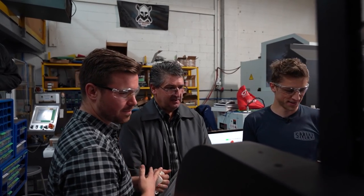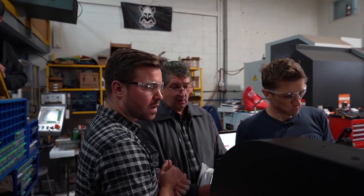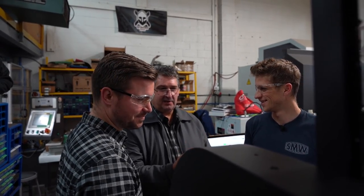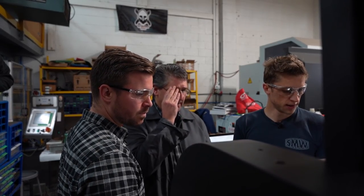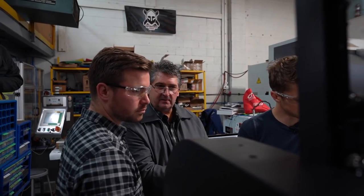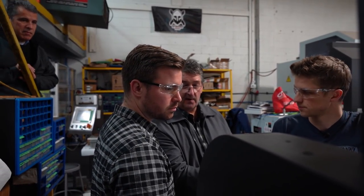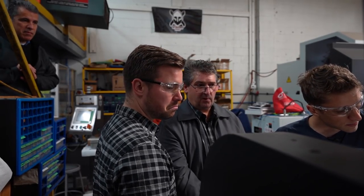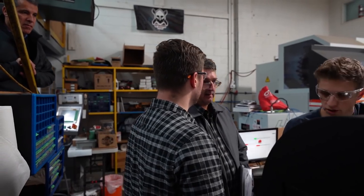Well, our applications team are pretty good. So they'll work with you on getting it all ready. And even before he bought the Nakamura, he basically almost virtually self-taught himself to run almost every machine in here, and this is a little bit more complex than that. Mind you, once it's set up, that pain's done, and then it's just repeatable. Everything's very near to the spindle, so the concentricity of the part's much better on this because of the headstock design versus the chuck, and for smaller components, it can't compete. It's two different animals completely.